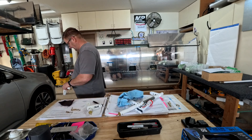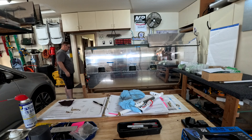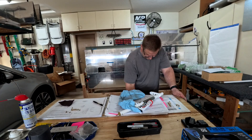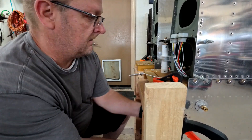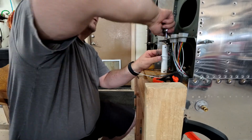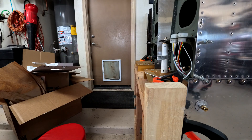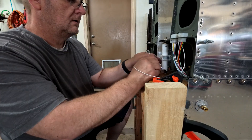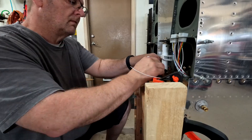Speaking from experience — I did assemble it that many times. I actually bought new locking nuts for that particular assembly because I had done it so many times. But I learned my lesson. And there you go — that's kind of what it looks like. It just moves back and forth, and it will connect to the push rod. You can see the little gold piece in the wing — that's the aileron push rod. You put the little bolts in once it's all in the correct holes, and that's the last step.